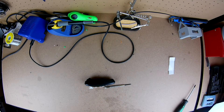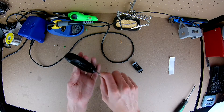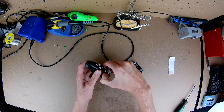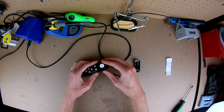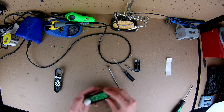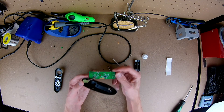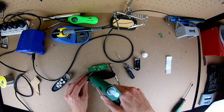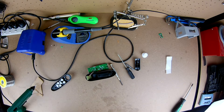I'm going to voice over this build process so this video can serve as a tutorial. These controllers are quite easy to pull apart — open the battery compartment and undo the two screws inside. The top doesn't quite pop off; you need to get a small flathead screwdriver into the sides and click out two little pop tabs up towards the joystick. With the top off, the circuit board pops out easily, but be careful not to move the front buttons out of their housing. Personally, I remove the circuit board and apply hot glue directly to that front board to keep it in place.